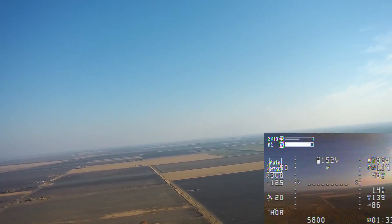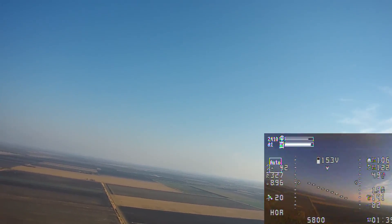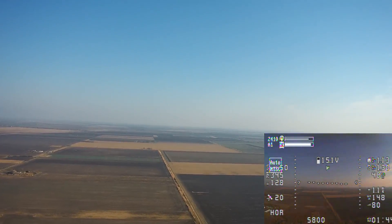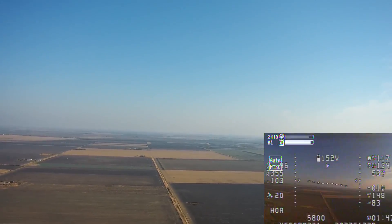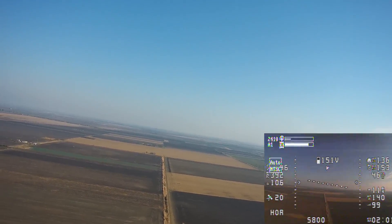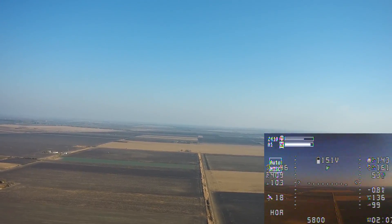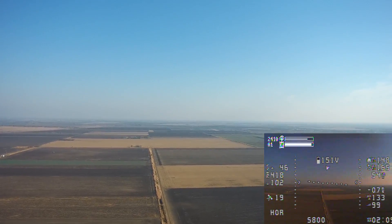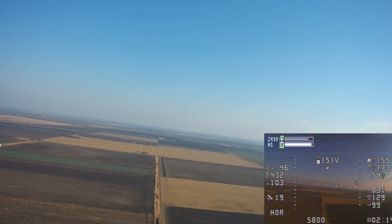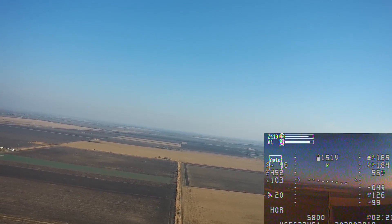The flickering isn't as bad as you see it in the DVR, but it was really annoying to watch — that auto NTSC and auto PAL switching. Basically it was on NTSC; I should have thought about it in the beginning because it kept jumping to auto NTSC. When you boot up your VTX and Fat Shark module it picks it automatically, but it just kept coming back. I should have set that manually. Make sure you set it correctly to your NTSC or PAL camera so you don't run into this issue.